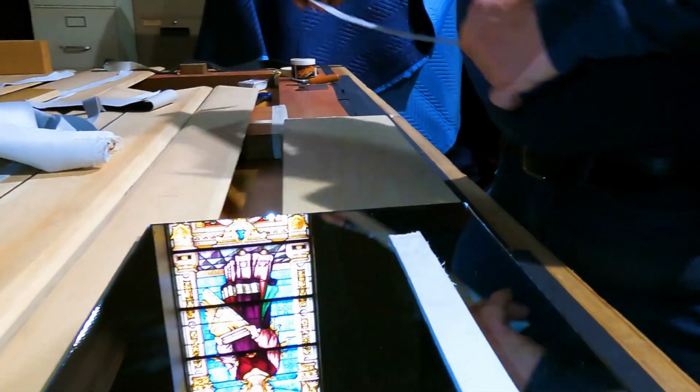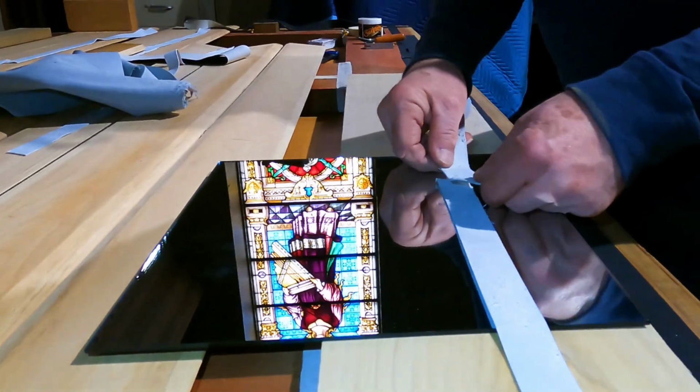But it allowed us to stick those strips on with fish glue and not dissolve and soften the joint we made to make long enough strips to use. In that case, it was an advantage, but we did not use it in a place that was structural.